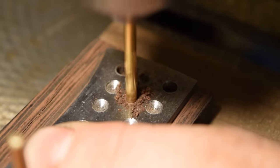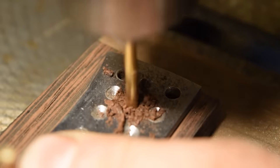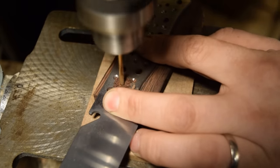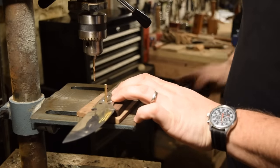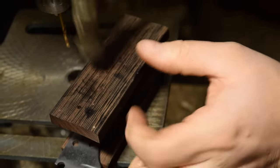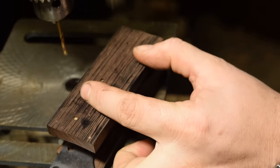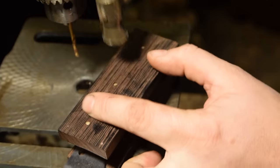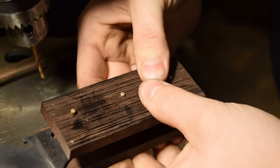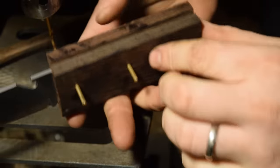Then with those two pins in place, then you drill out your third hole, and then you follow that same process with your second scale. What you want to do for your second scale is you clamp it on where you want it, drill your first hole. So then you have your first hole drilled, run your pin through, and then you take your first and your second scale, put them together and run two pins through, and you drill through the holes of your first scale down through everything. That way you know that the holes in both scales are going to line up perfectly when you're actually doing your final glue up, setting everything together. So just the process of kind of knowing what to drill so that way everything lines up later, using as much of your existing holes as possible.